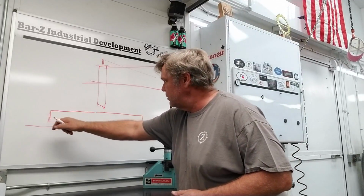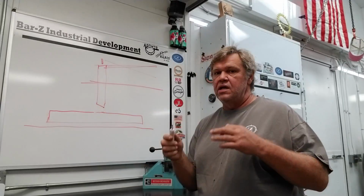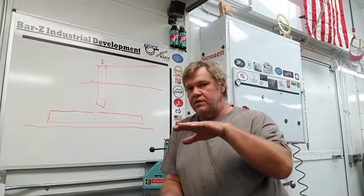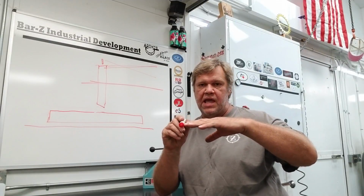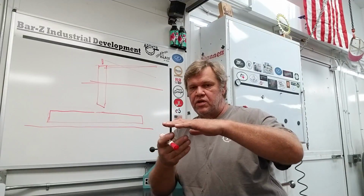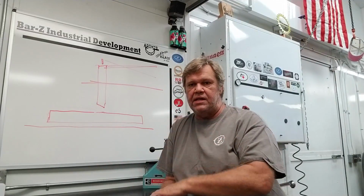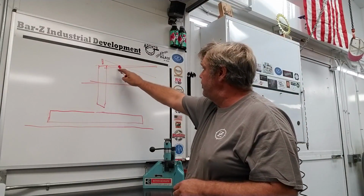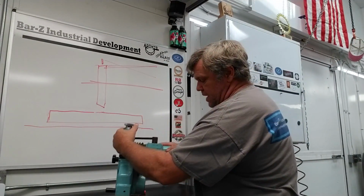But when we're coming the opposite way, you're only touching one spot. You're not getting all that contact, and you're not getting that good averaging as you're passing across on your flat work. You want that wheel flat. You want to create that averaging because every part of the wheel has a job. The leading edge is doing the heavy cutting, and as it passes across with each step over, you're getting all that averaging of that wheel and creating that surface and getting it flat and parallel, everything else. So that axis has to be adjusted very finely,